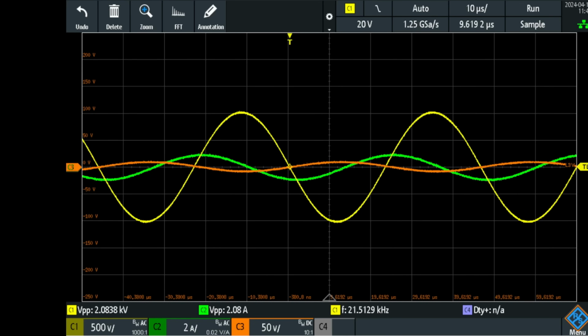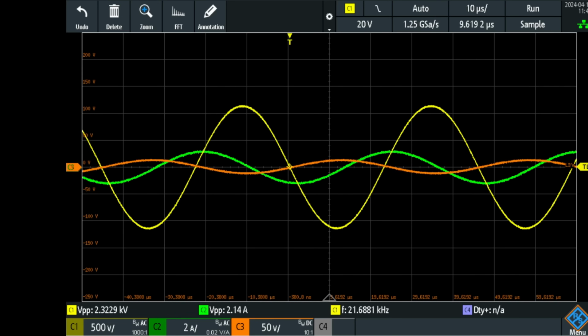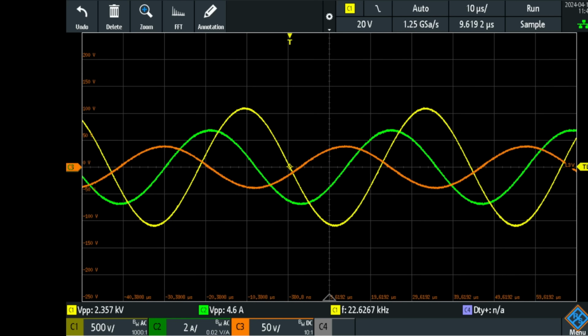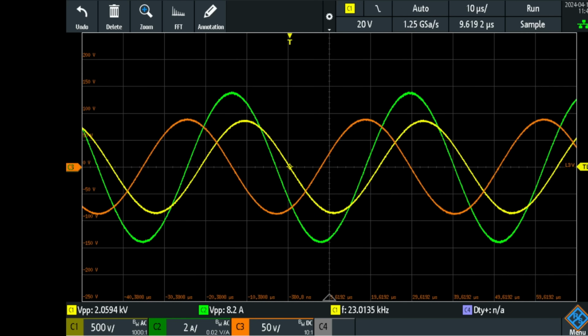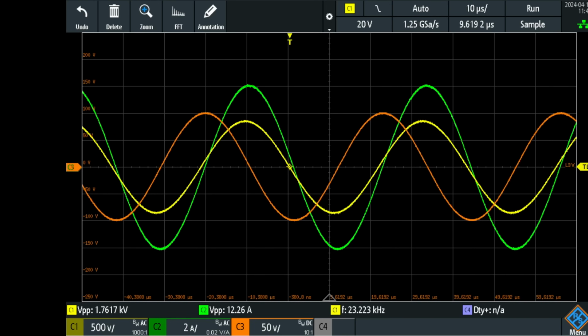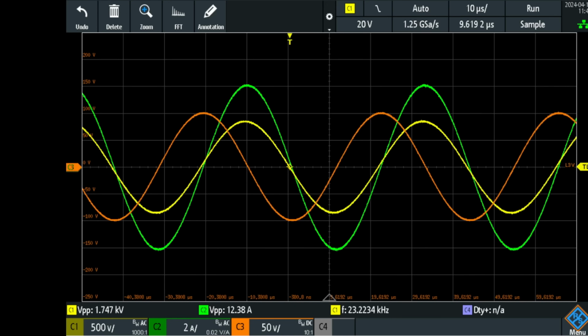Going up. And let's see if I can find that maximum of the voltage again. That seems to be here. And now the voltage goes down. The current goes up, and the current reaches a different resonant point. So now everything appears to be in phase again.